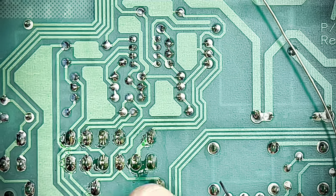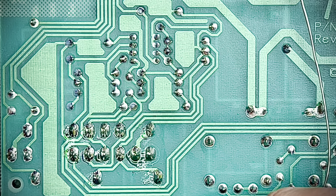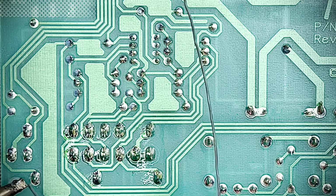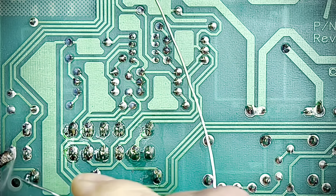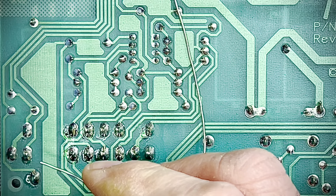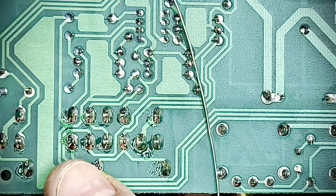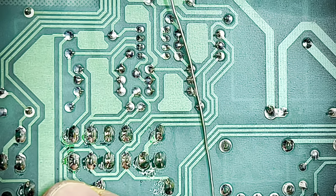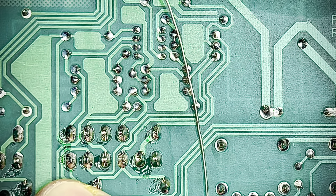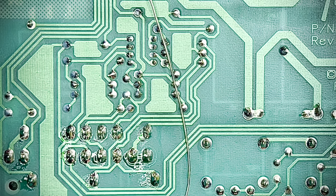And the beautiful thing about this eutectic solder, I'm going to jump back up on my soapbox here, is there's no intermediate state. It's liquid and immediately goes back to a solid. There's no plasma or a plastic state in the middle of it. So what does that mean? That means while you're burning your fingerprints off, waiting for the joint to cool, you're creating a bit of an internal air gap inside of that solder joint. That's no bueno. Part of what makes the eutectic stuff beautiful is that it's instantly a solid. As soon as you take the iron off, within a couple of seconds, it's solid again. Makes a beautiful joint.